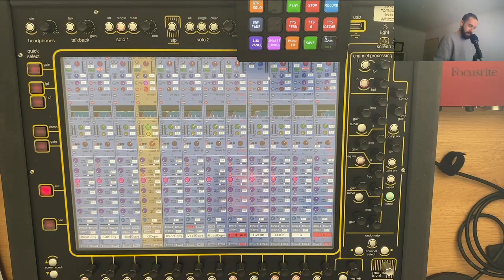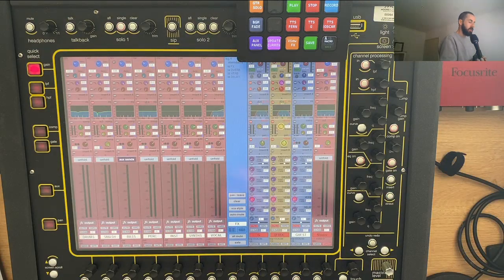And then my last bank on this layer, so if I'm working down, this is number 4, is essentially my show bank. And this is something that I always do on every console that I get onto, whether it's a Digico or an Avid or a Yamaha or a D-Live or whatever it is. I always have a show bank, which is essentially somewhere that I can live for the duration of the show, and I have everything that I need to get to in a really quick way if anything happens. So these are all my groups.